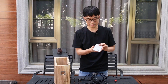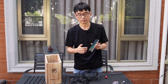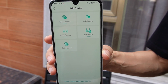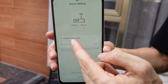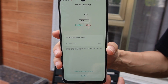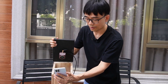Now we need to bring up the mobile phone and connect the camera to the router. The camera needs to know the Wi-Fi password and SSID, so we need the help of the app. Let's click the app button and choose the Wi-Fi camera, then click Next. Here is the information of the mobile phone connecting to the Wi-Fi — this Wi-Fi information will be sent to the camera. Click Confirm, then Next. At this moment, I need the camera to scan the QR code so it will supply the username and password to save to the camera.